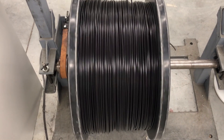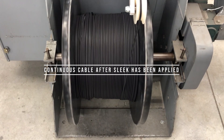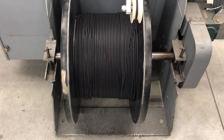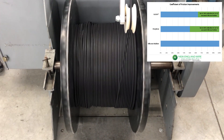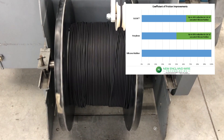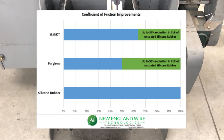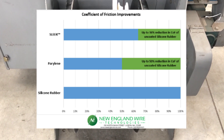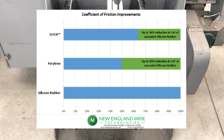Sleek is not only cost-effective, but is readily available in continuous length and has the ability to be overmolded. We've reviewed the reduction of tackiness Sleek provides by investigating the coefficient of friction — what this tells us is how much resistance there is against the cable while being dragged along a surface. Compared to silicone rubber with no coating or release agent, there was a noticeable reduction of approximately 36% in tackiness, which is not too far off from the more costly alternative parylene coating, which provides a 50% reduction.